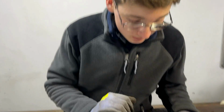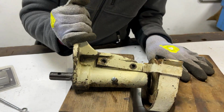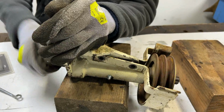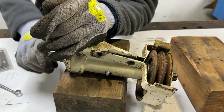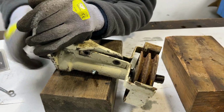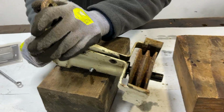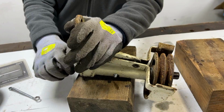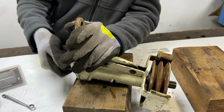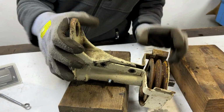But now with that greased up, we were doing it very carefully because we didn't want to blow either of the oil seals. But now we can feel how this turns, and it does turn very smoothly, very nicely. And looking at movement on anything, can't feel any wear movement. So that is perfect, as you'd expect with all new components. So I think that is a job well done so far.